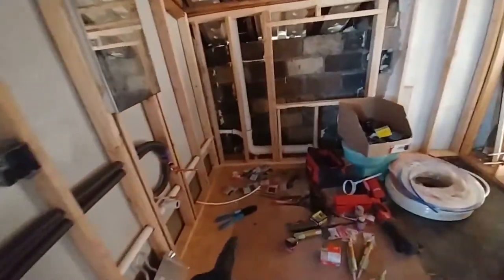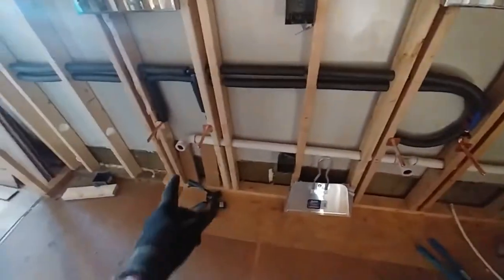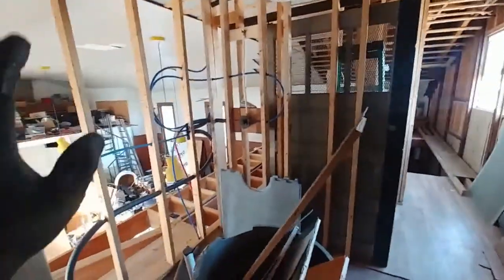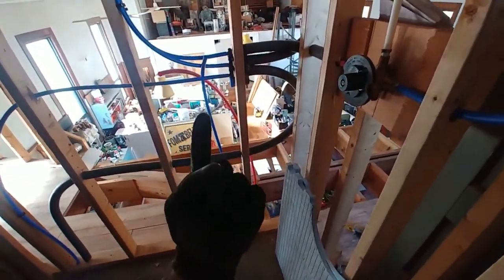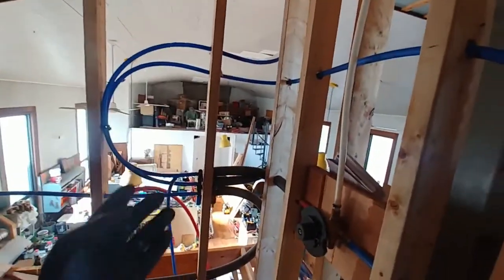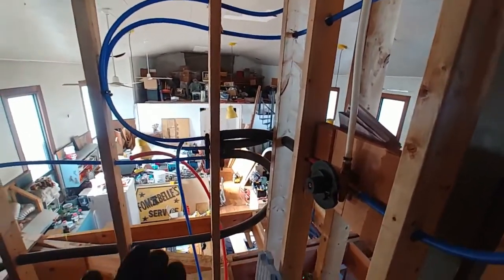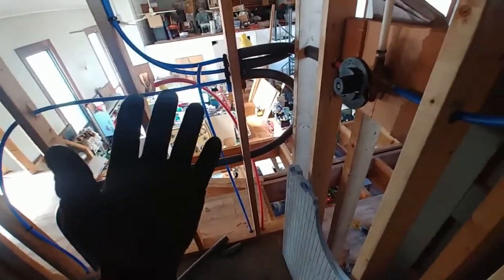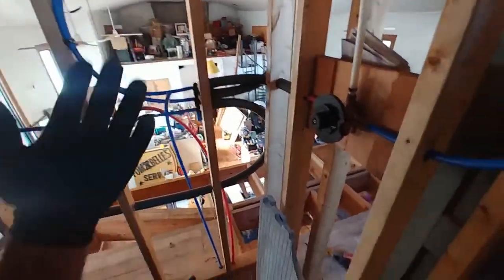Anyway, I haven't been back in here in a while for an update. I've been working the last few days on plumbing and stuff, so generally speaking, drains have been in, like we looked at, but also now water supply is in here. And ultimately, I went for fewer connections, fewer fittings. There's less time spent putting in elbows and tees and doing bends and routing based on that. More precise lengths and stuff so that it looks nice and is orderly, and there's fewer fittings purchased overall, and in the end there's fewer opportunities for things to fail because most of these circuits, if not all of them,